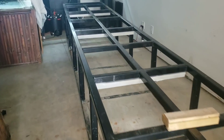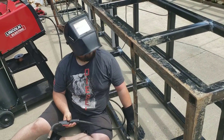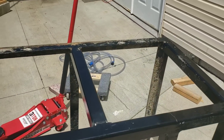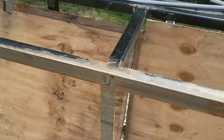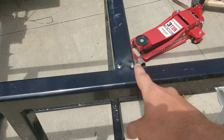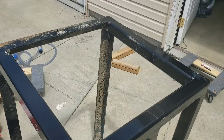The stand is tacked. We lost all of our help so it's just me and Stephen out here with our dollies and a jack. We ran out of gas after tacking the stands together, so we went ahead and got welding wire with flux in it — we don't actually need the gas. The welds aren't as pretty but Stephen is still doing a fantastic job. I'm working on grinding the welds down so when we paint them you don't see big globs. He is jumping back and forth to disperse and distribute the heat from the welds, which is the proper technique.